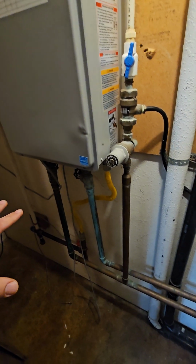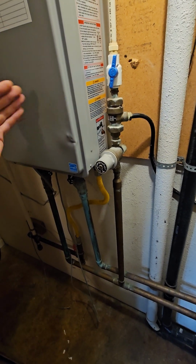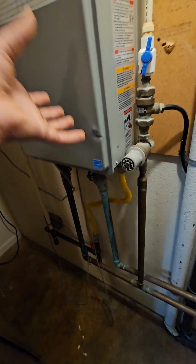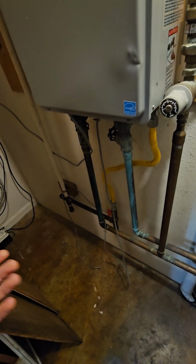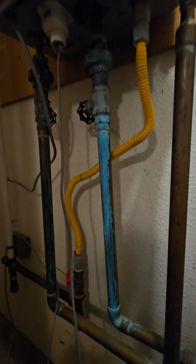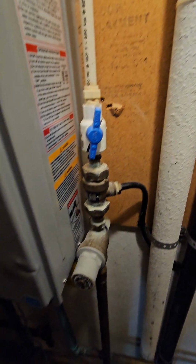And I'll just say one last thing. When you have a temperature, like the flame temperature and that heat being transferred into the water temperature, the greater the difference between the flame temperature and the water temperature, the greater and more efficient the heat transfer. So that's why you want to have as low a temperature as possible for the water return temperature, so that you can have a lot of heat transfer and a lot of condensation to extract the latent heat and everything from the system. So anyway, that's what the plan is here,